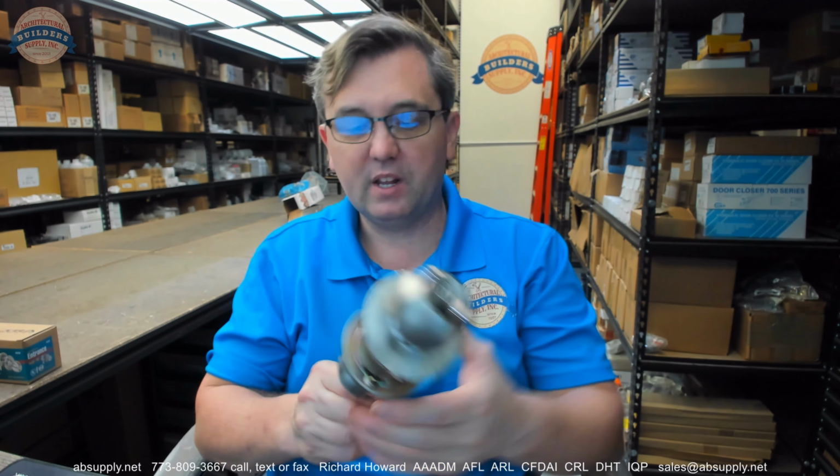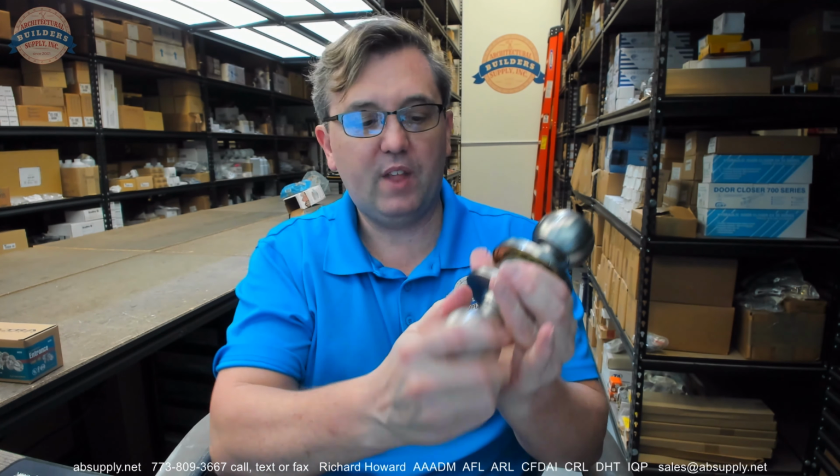Let's back up. When I'm able to push that knob down onto the stem, the tailpiece is there, but it's a bit tapered at the end. And as it enters the plus sign, the stem of the knob assembly gets to the point where the C-clip can pop back out into its slot. But because that tailpiece is tapered, there's just enough room for it to move in, and then as you push it down, it will pop into the slot. The tailpiece is in the plus sign in the horizontal position. Anyway, a study of the lock would eventually give you that knowledge. So, right hand, and that's that.